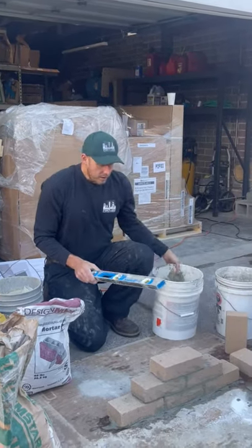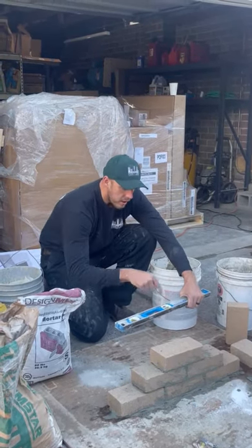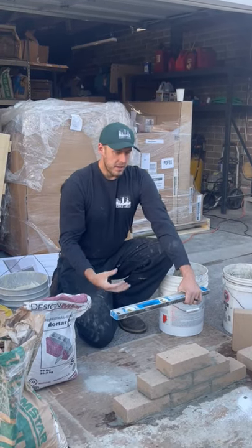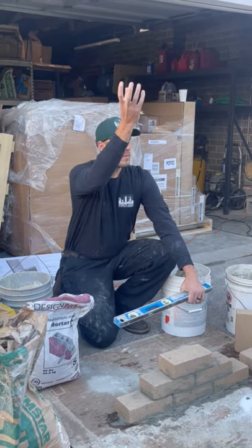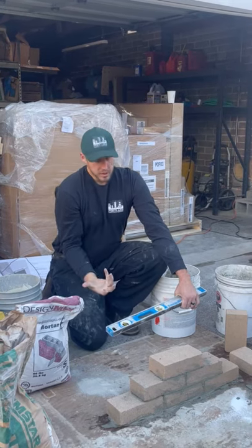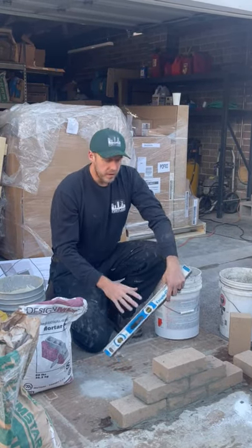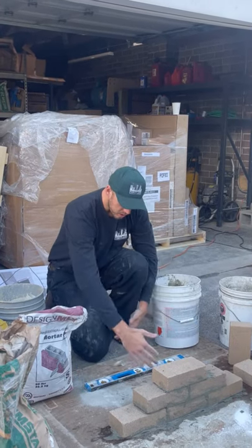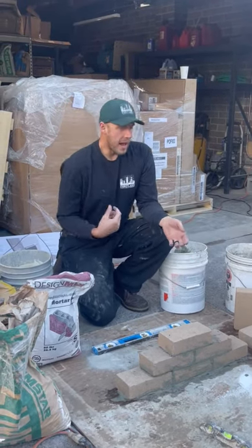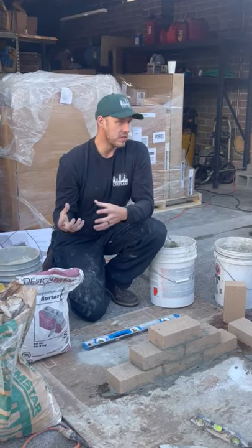When you build it log cabin style, like this, the surface area of the wood that is burning is just right here, so what happens there is it's not quite enough heat to push through some of that negative pressure and air that's coming down the chimney, and it just has to do with complete combustion of your fuel source. So once you get that light wood burnt down, maybe 10 minutes, the light wood burns down into coals very, very quickly. You want to have a nice coal bed underneath your grate, because that's the foundation of your fire. It's what substantiates adding in a larger fuel load, a larger diameter of piece, or a more energy-dense species of fuel.